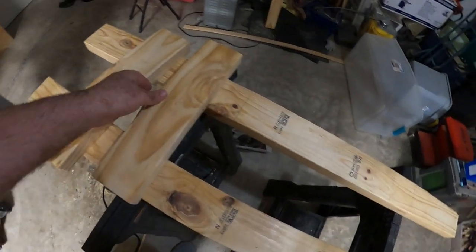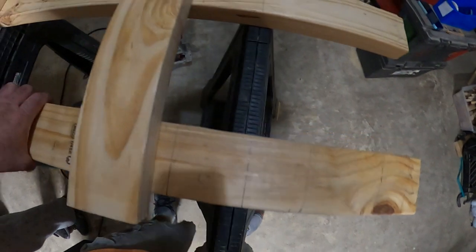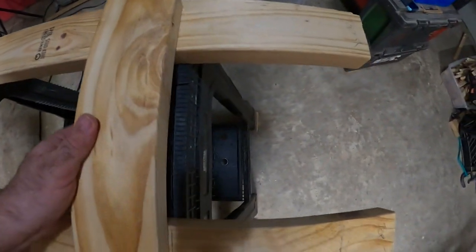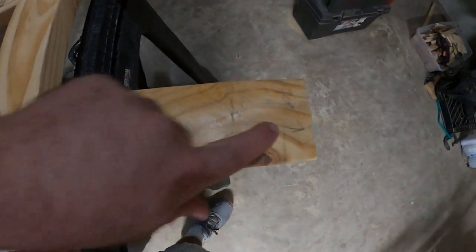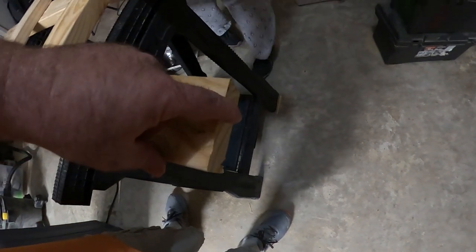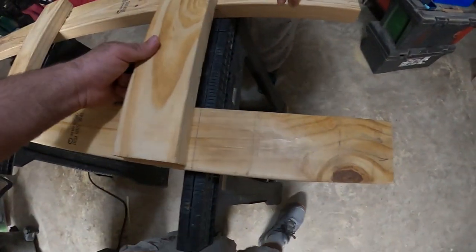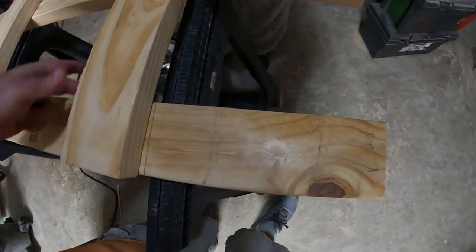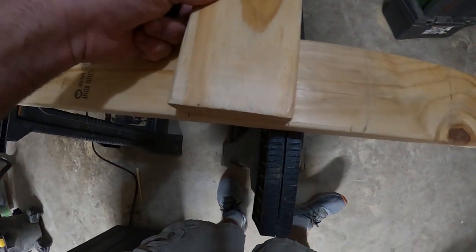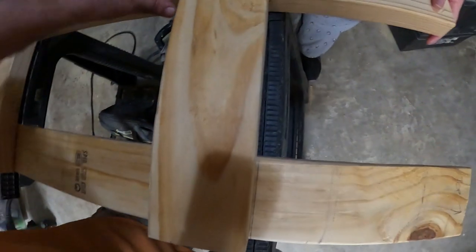Alrighty guys, so we got the 15 inch boards cut here. So I've already got lines marked where I want the 2x4s to sit on both sides. I have it labeled for top. The reason why these are labeled for top is where I actually cut basically 8 foot into 4 foot. So I want the part I cut on top. So now what you want to do is get it nice and flush and level.